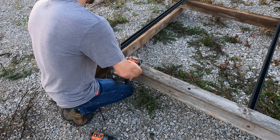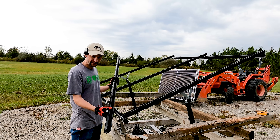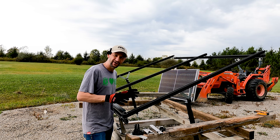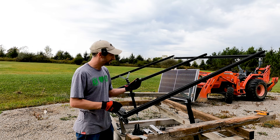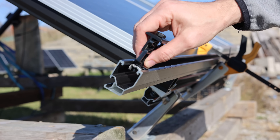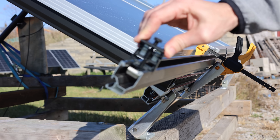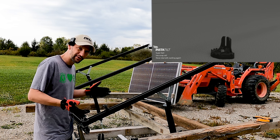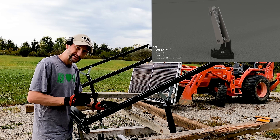I'm playing around with some new racking here that I'm using for this fixture. Pegasus sent me their rail system to try out. They have these really nice lightweight rails and some very innovative ways of putting them together. Their mid clamps have a plastic spring designed right into them — it holds it up at the height it's supposed to be at. You just stick it in the track, twist it in place, and it stays right there sprung up so you can put the panels right under it. It's pretty nice.